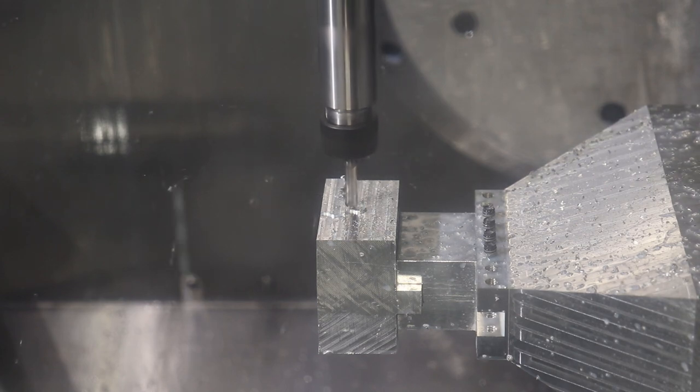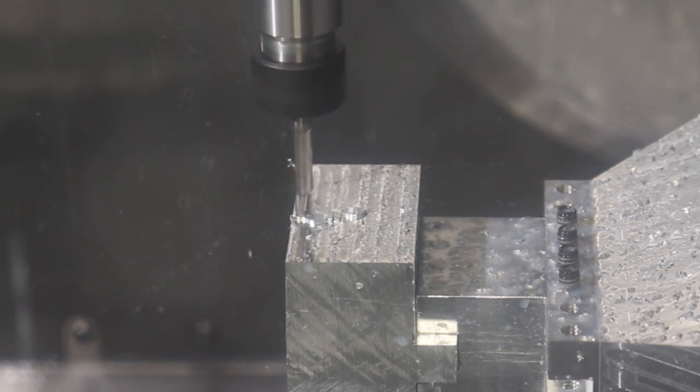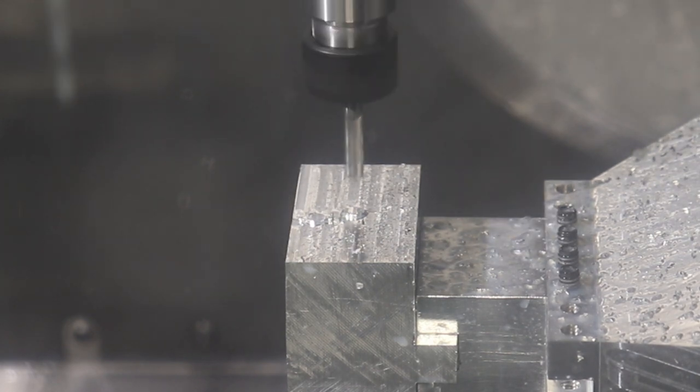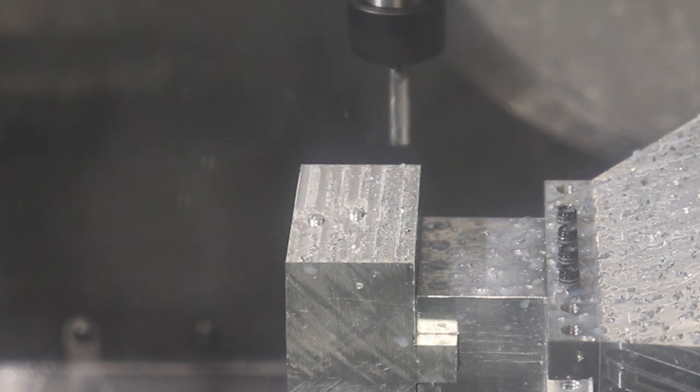You probably see there's a big edge on that cut, or a big burr, which may indicate that the tool's getting a little dull, or with me not running the coolant for photography, we can be getting a little bit of a built-up edge.